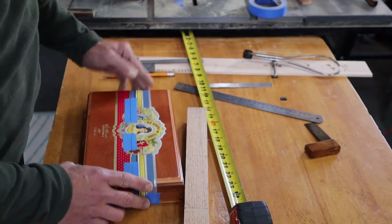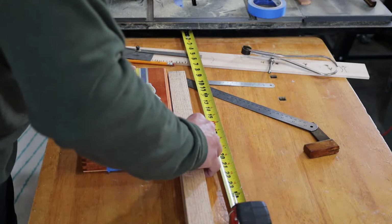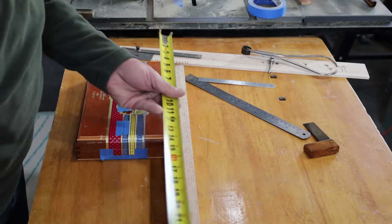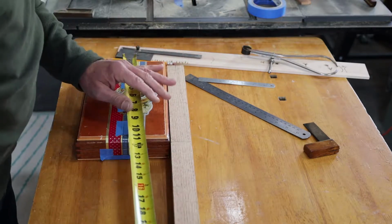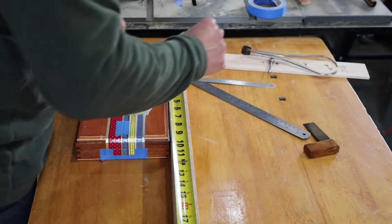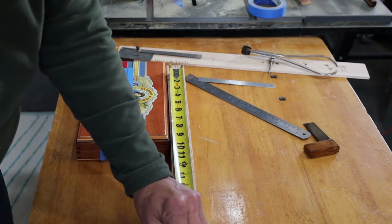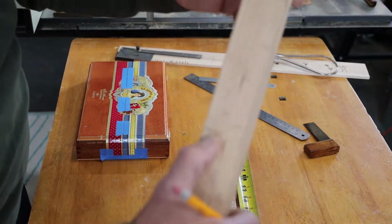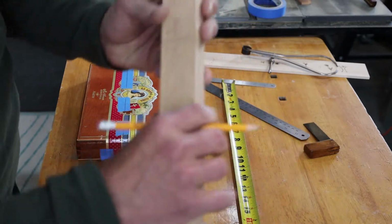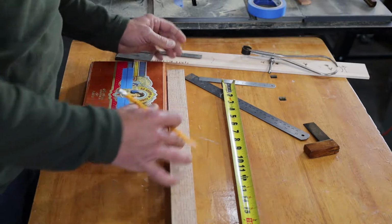So that'll dictate where the string nut wants to be. If I go 24 inches from there, and I already made a mark on the wood over here, my nut wants to land right there. That's where the string nut's going to go. So once I have those 2 points and 2 measurements, I have to stick with them.